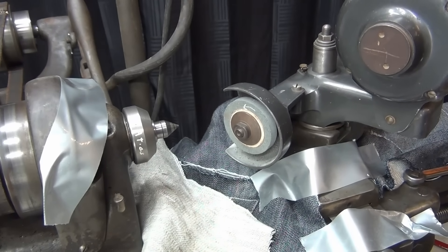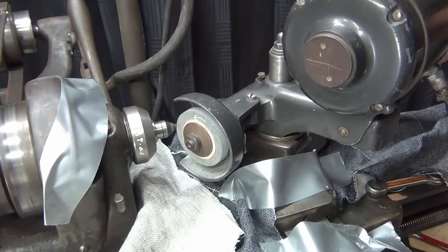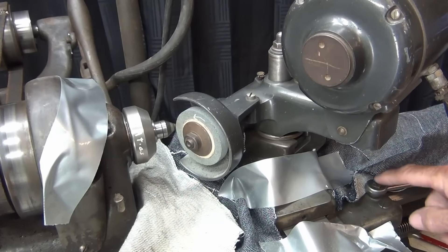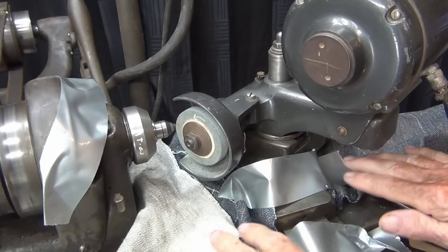What I'm doing now is advancing the carriage to get the wheel into position. That's about where I want to be, and I'm going to lock the carriage, because we are doing this by the compound rest method — which is exactly the same as turning a taper on the lathe using the compound rest. Remember, it's a 60-degree center, so we want that to be exact. Now I've got the drapes on here and it looks like heck.